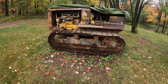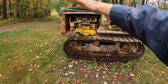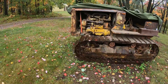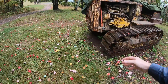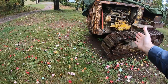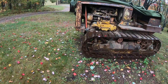Whereas if you put a dozer blade on this tractor, because of the slightly shorter tracks and the weight balance bias toward the front of the engine — because we're expecting to have a load back there to even things out — there's not a load, but you've got all this added weight of a dozer blade up front, especially that huge C-frame LaPlante-Choate angle dozer that was on this. And you go and raise that dozer blade and back up, you've put even more of your weight bias further out ahead of the tracks. And it makes these tractors just stand right on their nose.